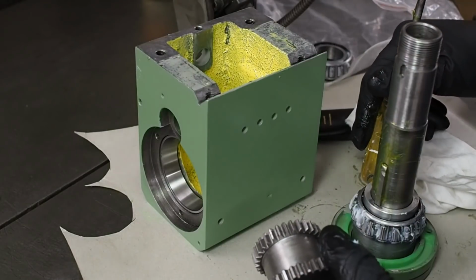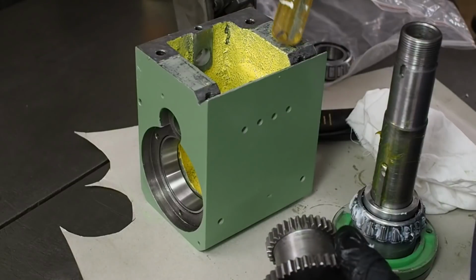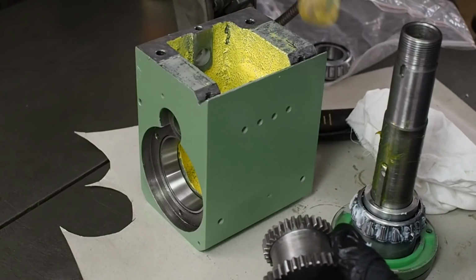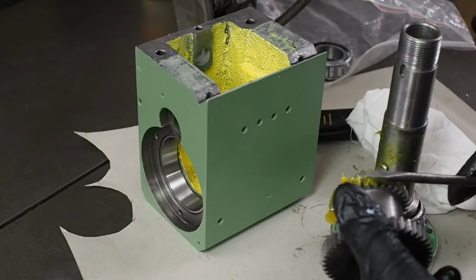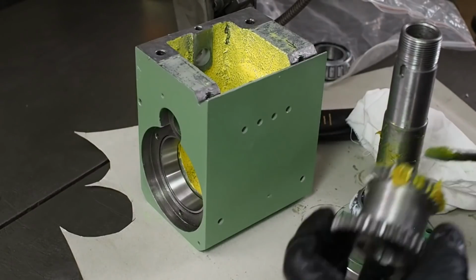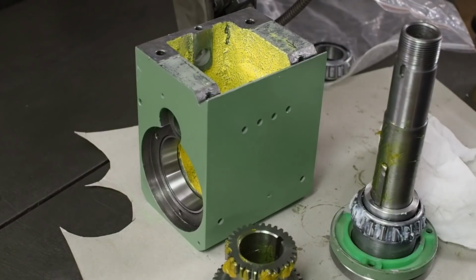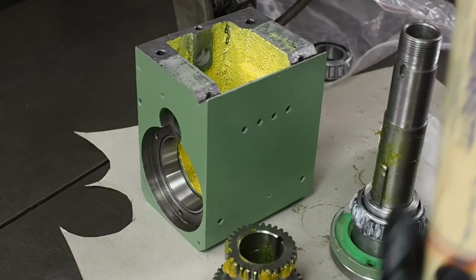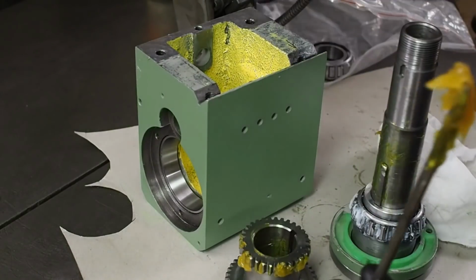There's been some discussion in the comments section about sealing this head casting and running these gears with oil, which realistically would be a very good idea, because I'm a little concerned that they're going to be so noisy, it'll be horrible to operate. And the second thing I'm worried about is that they're going to wear out too fast. Sealing this head casting is not going to be something trivial.